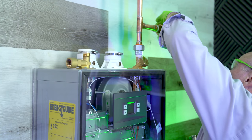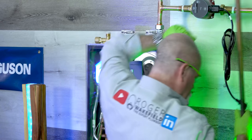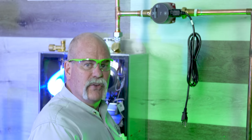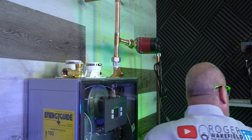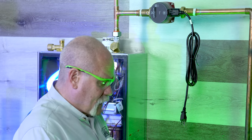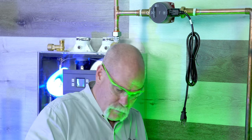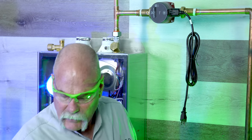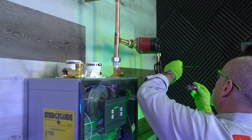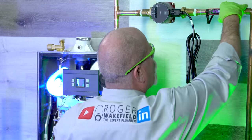Make sure you get your washer again. Now you see we've got everything in — this line would come down and go to your dedicated return line. Now we're going to install the temperature sensor, and this is pretty cool. One of my favorite things is the wireless communication — there is no wiring. We open up the cover, pull the paper out to activate the battery, and now it's touching and we've got Bluetooth connecting. I'm going to put this right around the pipe where I want it — the wireless temperature sensor is now right there on the pipe.